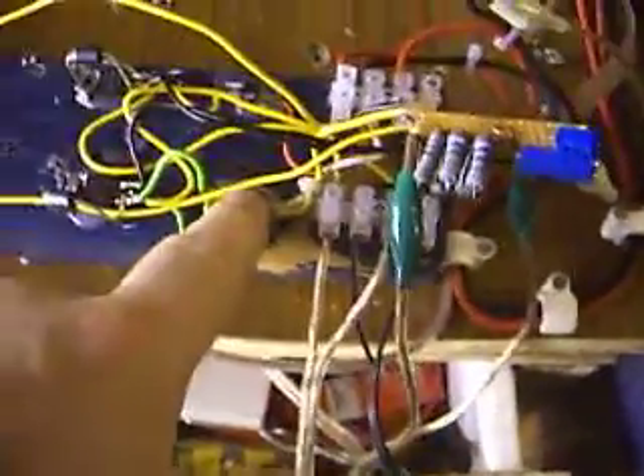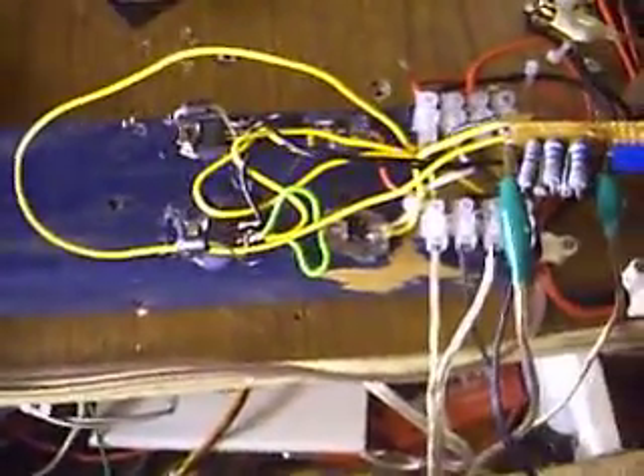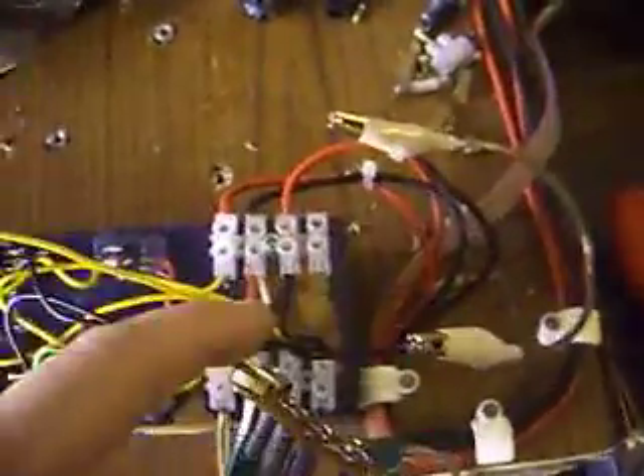A few problems. Let's take a look. As you can see here, a little bit of a mess, so my apologies. You have trigger, drive, and there's two batteries. Two optocouplers there, two transistors there, two diodes across the transistors. Simple enough, and as I said, apologies for the mess.